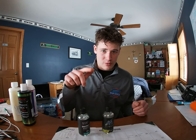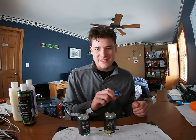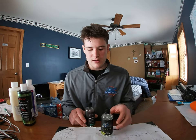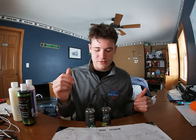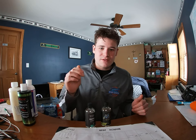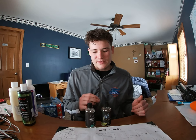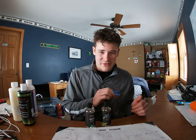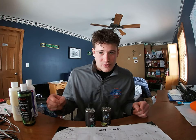When reapplying, it's very simple. The Repel Pro is the permanent barrier that stays on your boat, so after it's on, all you have to do each year is polish the boat to get a clean surface and then reapply the Liquid Door SiO2 top dressing — that's it. You can use these products separately, but combining them gives the best results. Important: the fiberglass or marine paint must be in perfect condition before applying ceramics — if oxidation isn't fully removed, these products won't stick and you'll waste a lot of money. If you're not an experienced detailer, get help from a professional.